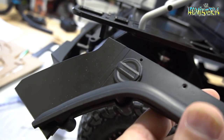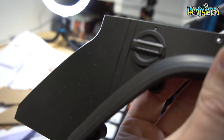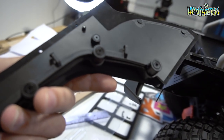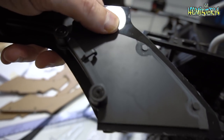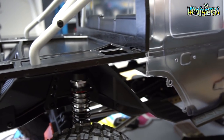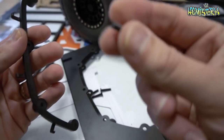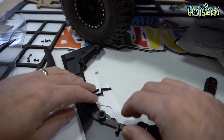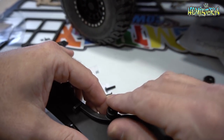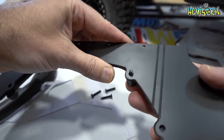On the other side I also relocated the gas cap to where it would sit on a Gladiator — in front of the left rear wheel on the driver's side, rather than behind the rear wheel. This side is already completely sandwiched together. You can also see there's an incredible amount of gluing surface left on each end of this fender piece, and plenty of bolting room to attach it to that Delrin bed section. This is all the stock hardware that I'm repurposing — it has plenty of length to thread into all of this. You can tell this fits nice and sandwiches together pretty nicely.